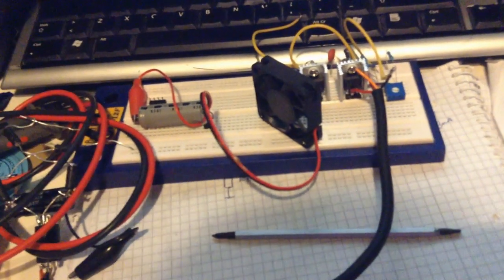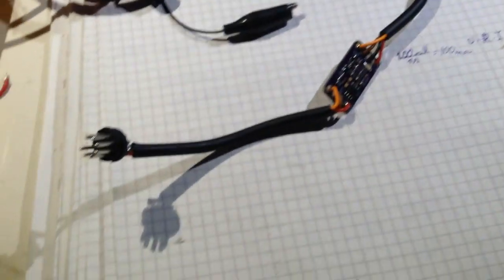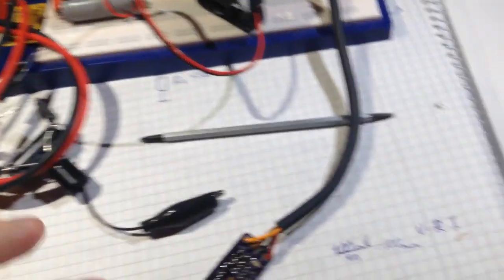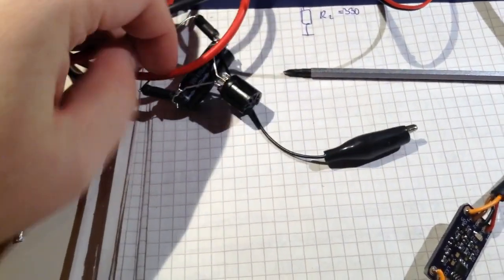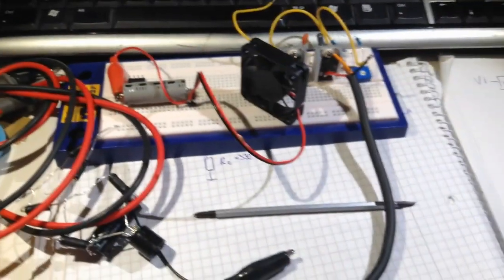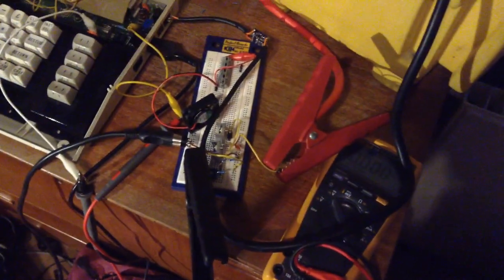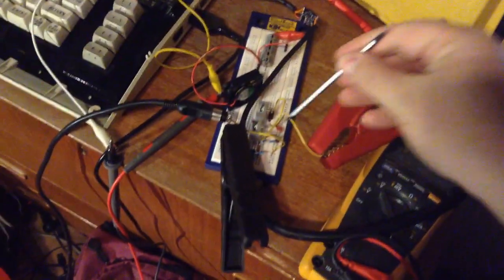I pull the voltage and current from exactly on the pin, because then I don't have to route all that current through this board, since this board makes many losses. Now I'm nervous, because now I'm going to try and adjust this one such that I get an overvoltage on my actual computer. I've seen it on my dummy load — it stops overvoltage perfectly. So I will start with safer voltages, then go for the full 12 volts. The Commodore 64 needs 9 volt AC with this power supply, so I need to resolve this plug to connect the Commodore power supply — to get 9 volt AC, and 5 volt DC from this board. They are completely isolated, so there shouldn't be any problems. I feel confident enough to try it. I haven't tried 12 volt yet, but I have adjusted this one up to 5.4, as you can see on the display.